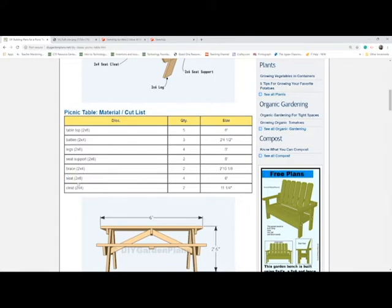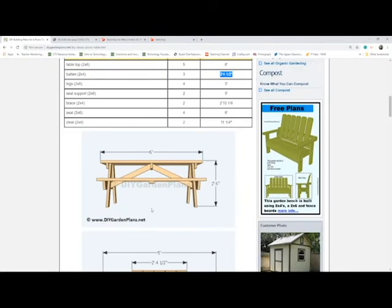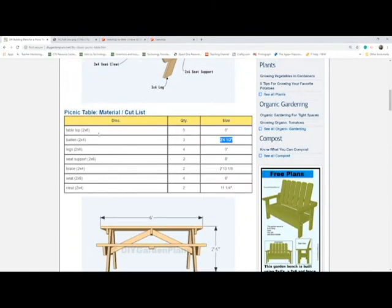We've got this brace, this cleat, the seat support, legs, and the batten to deal with still though. This is a 2x4 at 2 foot 4.5 inches. This is a 2x4 at 2 foot 10 1/8 inches. And I know there's some strange cuts that we're going to have to do in here too, because I'm looking at this picture and I can see there's angles that we're probably going to end up having to make. But to get started, let's go ahead and set our dimension up.